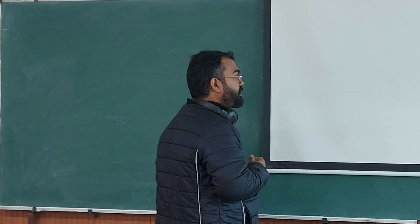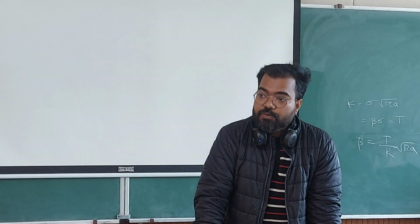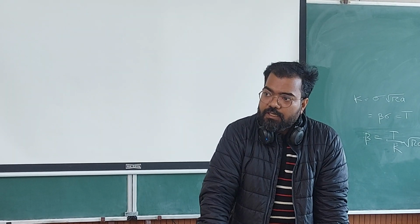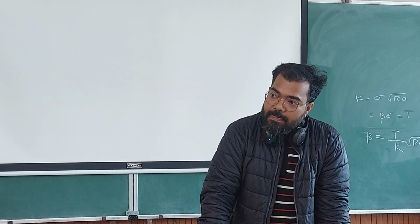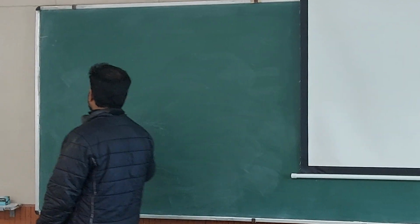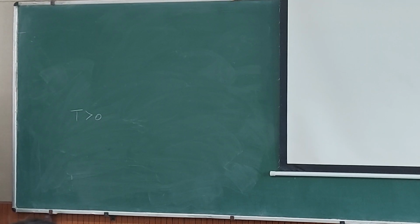So you need to ensure, even though we have taken care of all the criteria of ASTM E399 for K1C, that the plastic zone should be 50 times smaller than the smallest dimension, all those things we have taken care of, even then you will have a different value. Both of them are plane strain conditions, but in both of the conditions you have different amounts of constraint available, and so you will have a different value. So what people found was that if T stress is greater than 0, in that case, the variation in stresses is not that significant.